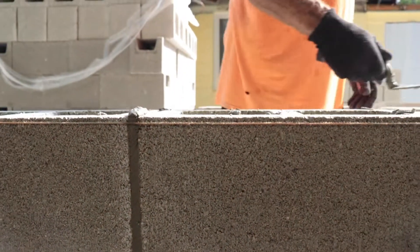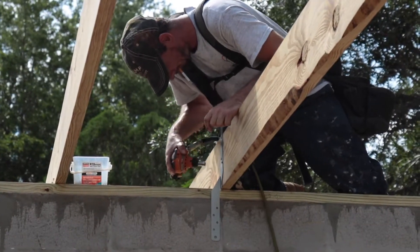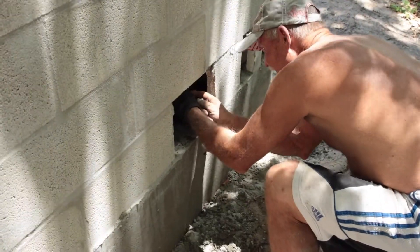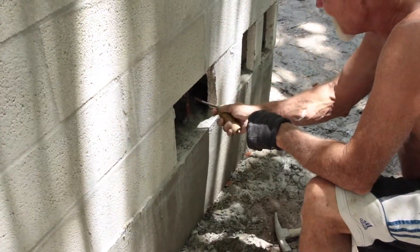All of that weight from this lintel goes down all the way to the ground. Whenever we're talking about framing or building anything to be structurally sound, the key is you need to get the weight safely from the load bearing point to the ground. The rebar adds rigidity as far as wind movement and racking — and that really is how the block goes together.